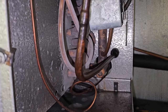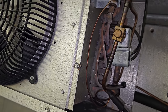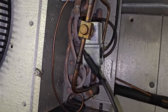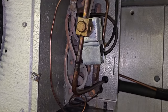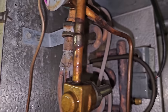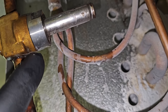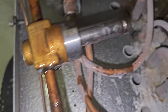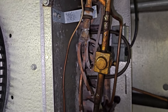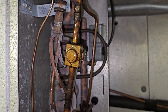I worked my way in here and we're picking something up. I see a slight bit of oil right in here. I came through the other day but it might have just been really low. We're picking something up in this area — I suspect it's going to be around the solenoid valve itself, because looking at it, it doesn't look like it's coming from a weld. I put some Big Blue soap bubbles on it and it is right on the underside of the solenoid valve. There are a couple little leaks on the mechanical fitting — I don't see anything on the stem. It's a very, very slow, small leak.